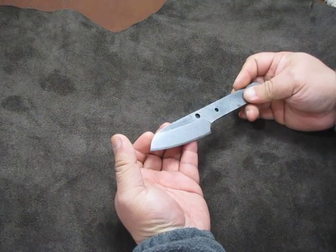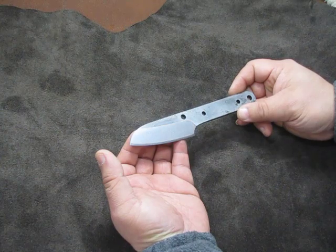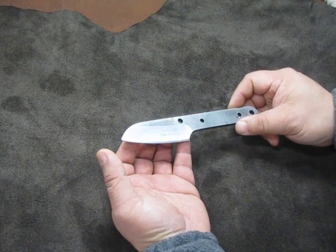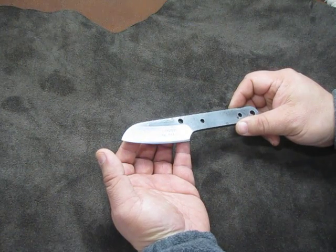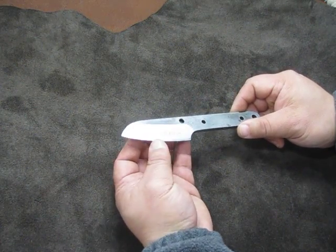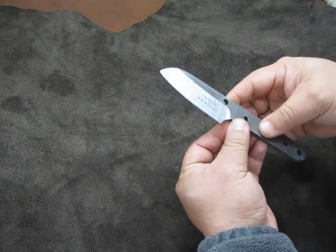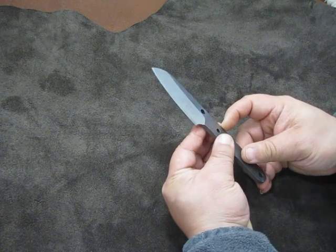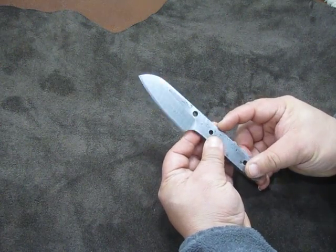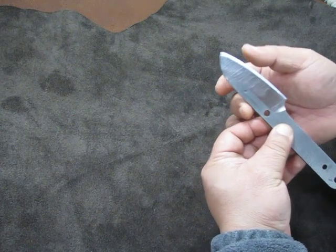Last year I got this CPM Rex mule from Farad Maré, who's based out in the UK. He said he was going to do a project involving this steel and everybody was eager to see what he'd come up with. The steel is about 68 Rockwell on the flats, which probably comes out to around 70 at the edge because it's a lot thinner. This blade is very thick, and it's got the hot-rolled finish on it. I reprofiled the edge to about 26–28 degrees inclusive — as low as I could get on my Wicked Edge. And let me tell you, this thing is sharp. The edge is so sticky it's scary.